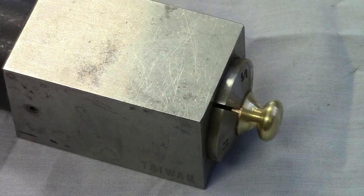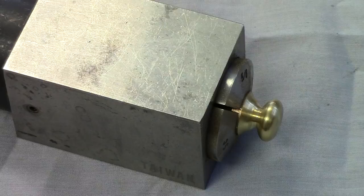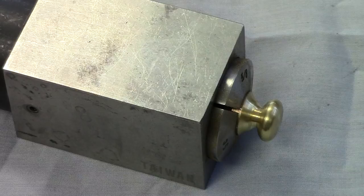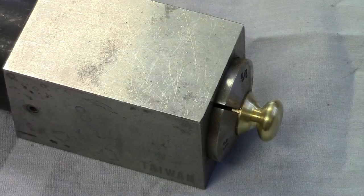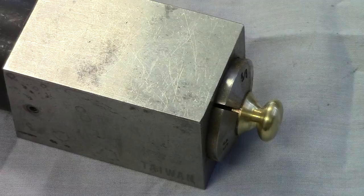Regardless of how you got your finish profile for your thumb screw, and regardless of whether you're going to have an inserted screw or a one piece, you need to perform this next operation before your last operation. And what we're doing here is mounting the part in a, oh, I can't remember what they call these, anyway, it's a square block, and what we'll do is put this in the horizontal mill and profile the sunken in cavity side